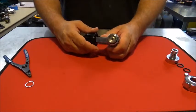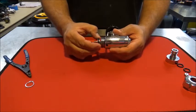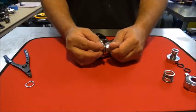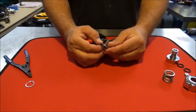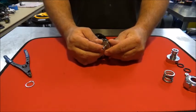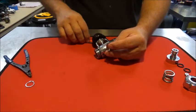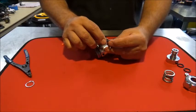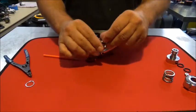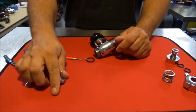Next is the piston, which is simply held in by the O-ring. At some point, U.S. Divers made a piston that was all made out of nylon or synthetic, but I haven't seen one of those in a really long time - I imagine they've all been replaced. There's an O-ring on this piston, and looking at this one, we can tell it's got some rust on there that we need to take care of.